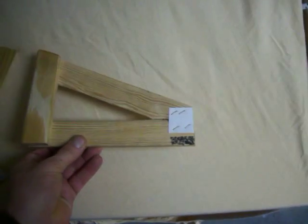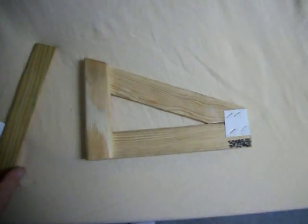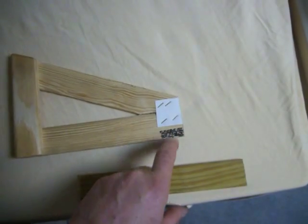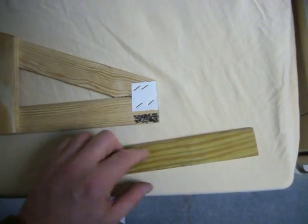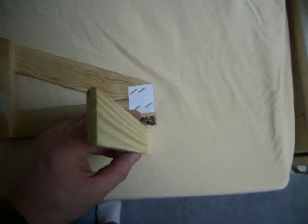Let me turn this over and we'll go with this representation now. The chimney - the water leaked in and this little black stuff represents rot that's on the current system now. So we have a load-bearing wall that sits right here like this, and this rot - the load-bearing wall is rotten. This is kind of rotten, and so it's not giving any support right here.